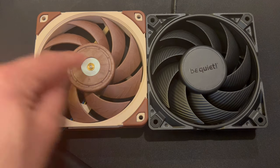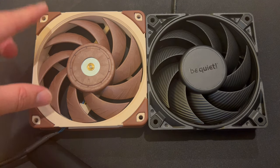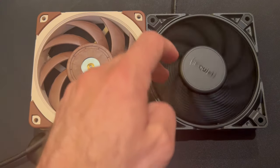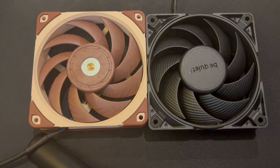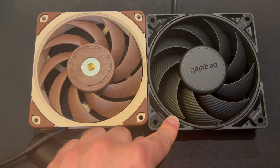If the materials inside the blade are too soft or essentially weak, they stretch over time. So a lot of really less expensive fan blades leave extra gap in there, so that as the blades stretch over time, they won't hit the frame. But there's a consequence to using higher quality materials, and that's extra cost in the fan. Meaning you now have a more expensive fan to reach the higher quality and achieve those higher performance levels.